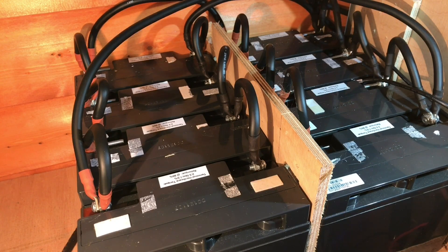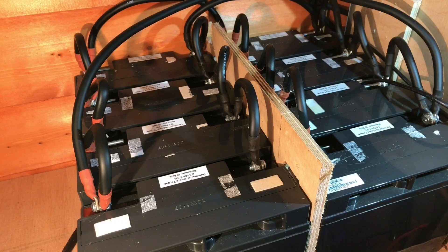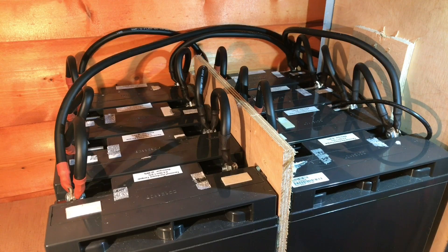What we need to do is put a load on these batteries and measure the current between each battery, and hopefully that should increase as we go along. I've got a 60 watt incandescent bulb that's actually lighting the batteries at the moment — I'm going to put that on my inverter. That incandescent bulb is now attached to my inverter, which is the noise in the background. It's going to be pulling around 5 to 6 amps, and that's been on for a little while, so I'm giving these batteries a decent test.